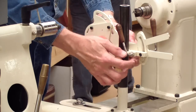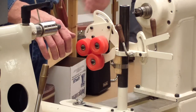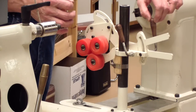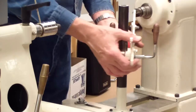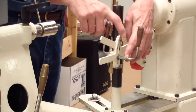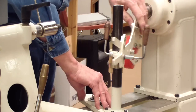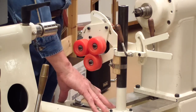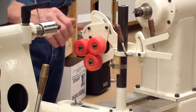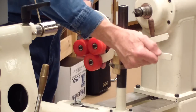You replace the wing nut with a threaded rod connector and your bolt. You take the bolt, you bend it. Since we're wood turners, we turn the handle to put on it. And right here, we have an extra 1/4-20 nut. This nut locks this handle in a user-friendly position. After I've tightened this for a while and it just keeps coming down farther and farther, unlock this, back it up, lock it back again, it's right there. Same way here. This is unlocked, and that's locked. It's real quick and easy.